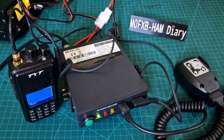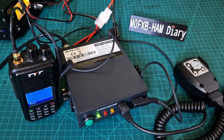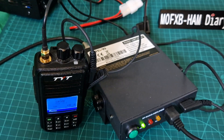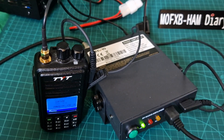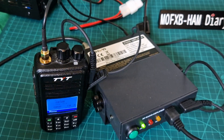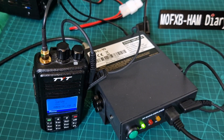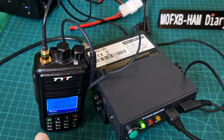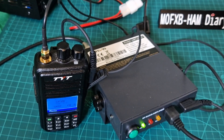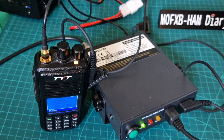We've got no alarm sounding. Transmitting now — you can see the TYT goes red and so does the amplifier. What I really like about this is it turns everything into a base station. Let's test it by calling my friend in Cheddar, about 15 miles away. You change channels and zones in the normal way, and volume the normal way. You are effectively making a base station at up to 40 watts. We're connected to GB3ZB — thanks for the use of their repeater.